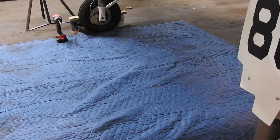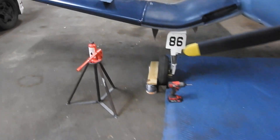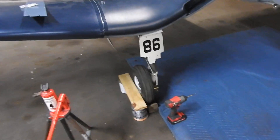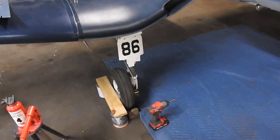This side was actually straight; the one over there was toed-in 0.8 degrees. Figuring out a tangent line from here out to roughly 85 inches — a little over seven foot one inch — I spent the day trying to get everything checked out, and that's when I confirmed I had toe-in.